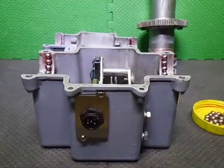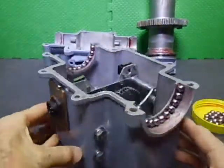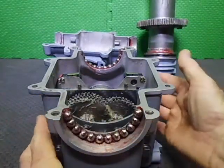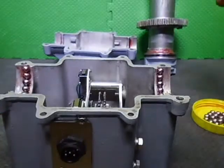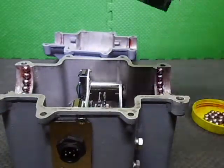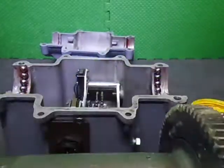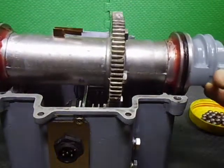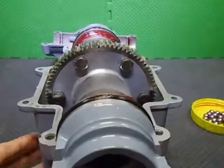Right. Welcome back to part 3 of the EV 780 rebuild. Okay, I have greased all the tracks and I've installed the top set of bearings on both sides, so I can actually drop the axle in. I've also pre-greased the axle and the gear. I didn't need to do all the gear, but I did it all anyway. So it's all done. So basically now we get ourselves square. Need to be flat at the end. That's where it's sitting.